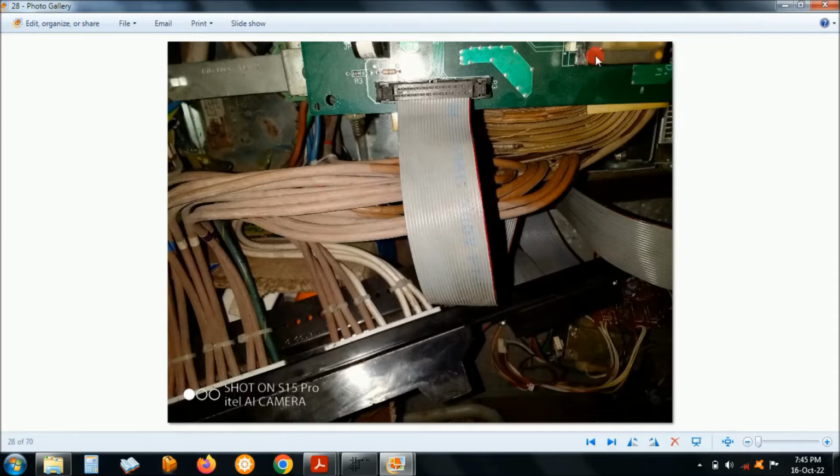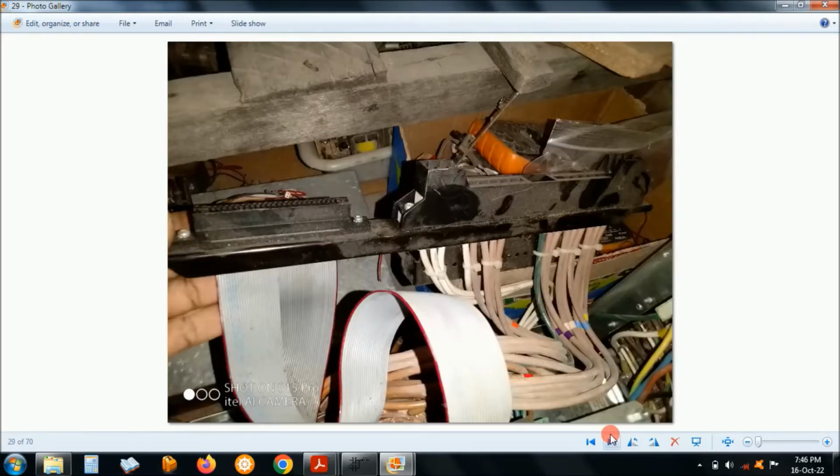Traced its wires from that small transformer using this cable back to the control circuit that I created with the PIC 16F887. Right, so I took out all this because they were not necessary. Okay, then I left these cables. These are for other control. I think it was mainly for automatic voltage regulation. So I was not using these ones. I didn't use those ones.